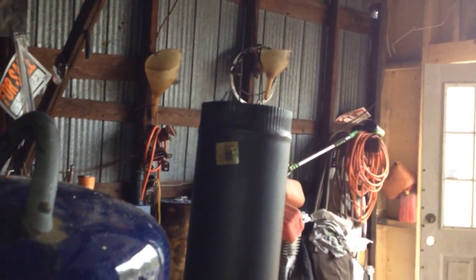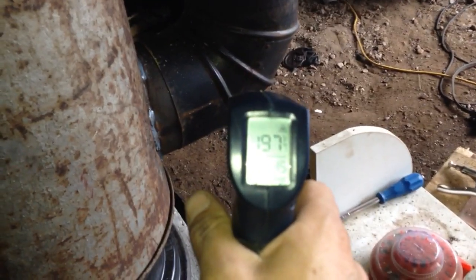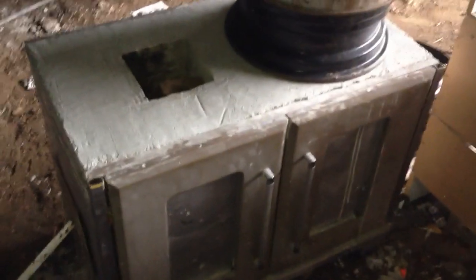It's still burning pretty clean even though we've got damp junk in there, which is amazing. The exit is reading 200 degrees, which they say is perfect — any more and you're losing heat, any less and you won't draw properly. We're right in the proper neighborhood. If I want faster or hotter heat I just use smaller sticks, softwood, or dry wood. Right now I'm running wet damp stuff but it's working. I just want to do a torture test — run this thing for hours on end and make sure everything is going to be okay. So far so good.